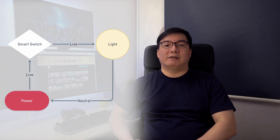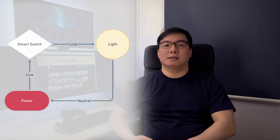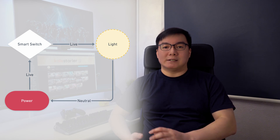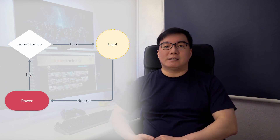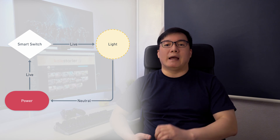How these effectively work is like dimmer switches. Instead of a hard on or off setting, power draw is increased or decreased. When the smart switch is off, there is only just enough power drawn to power the switch itself, and only a trickle of that reaches the light. This doesn't work for all lights however. If you're using a low power eco-bulb, that trickle of power may still be enough to power the bulb.